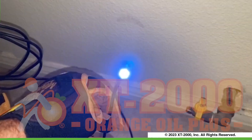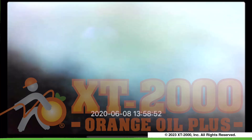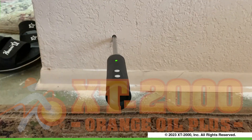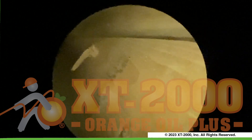Having an optical boroscope is so helpful because the digital ones were low enough resolution that it was easy to confuse cricket feces with termite pellets, or sawdust from roofing with termite pellets, or any other kind of building material or debris with termite pellets, and you might unnecessarily treat a wood beam. With this thing, it is crystal clear and you can totally see what's going on behind that wall.